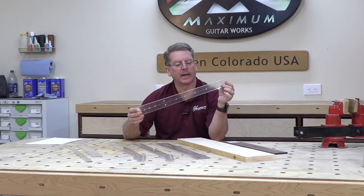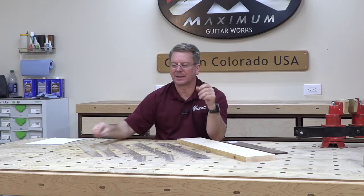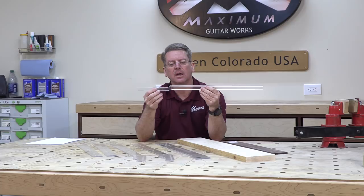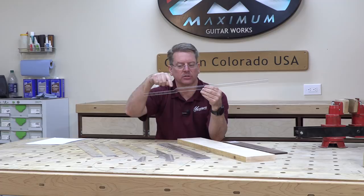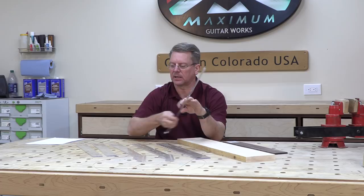We've also got templates for the fretboard itself, and that gives us the ability to place markers. I've got alignment pin holes that will allow perfect placement on top of the neck when we're ready to glue those together. I've also got a side view, which isn't always necessary, but I think in our case and the way we're going to shape out the top of the headstock here in the traditional Fender manner, it would be nice to have that drawn and connect some of the areas across the front so that we know where our stop points are, especially when we're taking this curve out and sanding that down to spec.